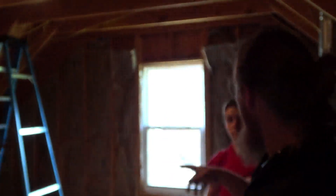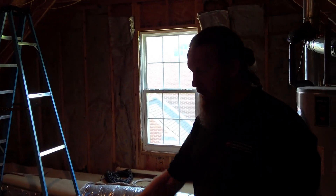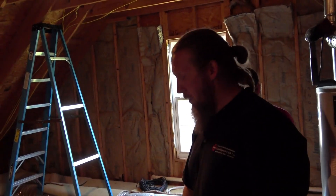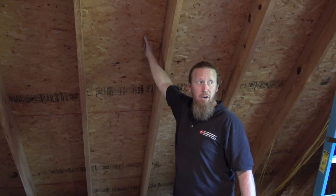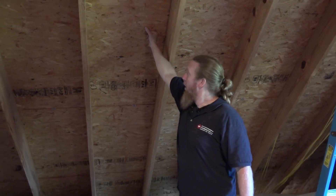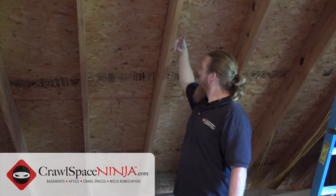This is Adam. What we're doing is putting our R-13 on the wall — you always put the paper facing in. Between this OSB and the downstairs they laid R-38, so it is insulated. It's technically an insulated attic. It's only 10 o'clock and it's already hot — all that radiant heat is transferring in through the wood and it'll transfer down.